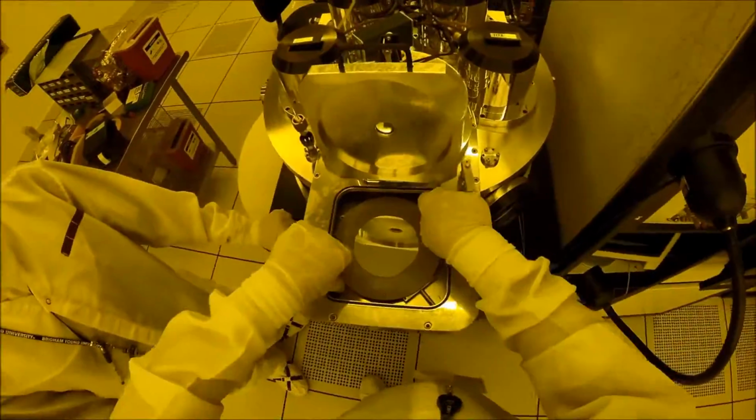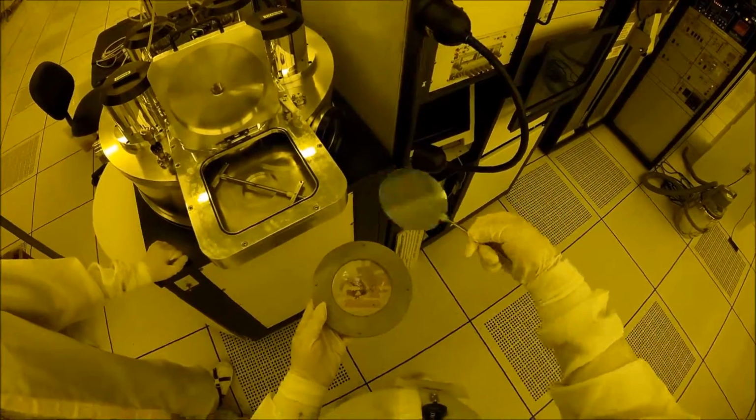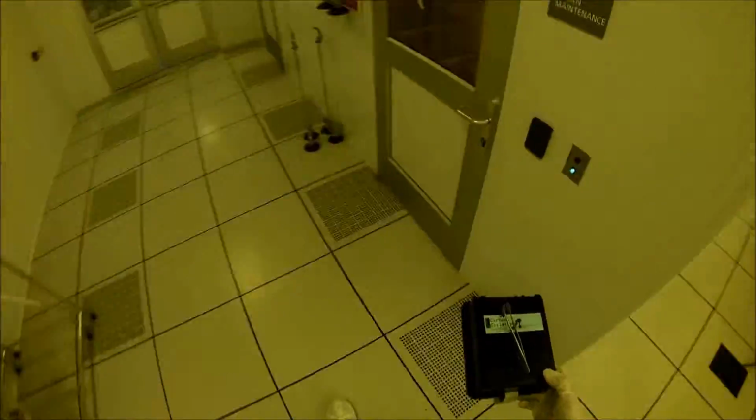Once it's finished, we're ready to get our wafer back, and you can see now that it looks like a piece of aluminum. So we took a silicon wafer and we've coated a very, very thin, pure layer of aluminum plus a little bit of copper onto the surface of it. So now our wafer is ready for the next step, where we're going to use sort of a photographic film with a stencil, basically, and corrosive acid to eat the metal away from the places where we don't want it. And so wherever we don't have acid touching the metal, we'll leave a wire behind, and that's what will form our circuit.